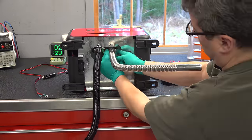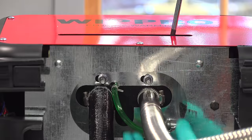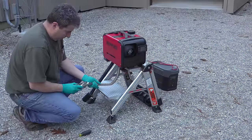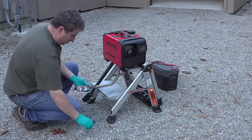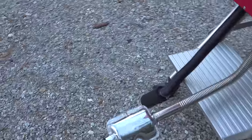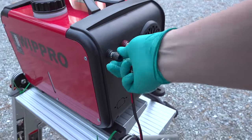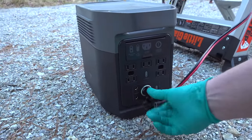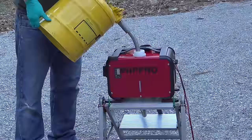The exhaust is entirely different — fully stainless steel, and this pipe is going to get hot. It can reach upwards of over 550 degrees, which can ignite things like wood and fiberglass. And though these things use diesel fuel to operate, you also require electricity to run the blower and electronics — a car battery or some type of 12-volt source able to output around 8 amps. The tank on this model is about one gallon, which is pretty typical, though you could certainly add a larger tank.